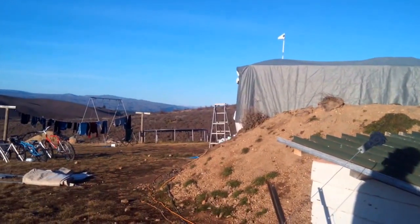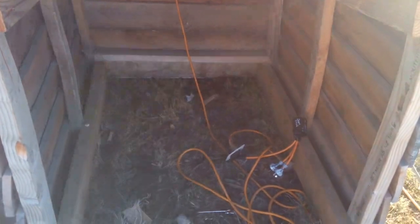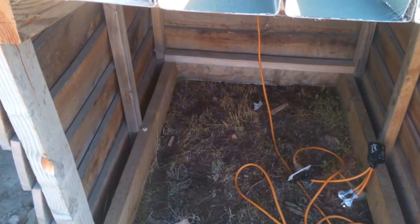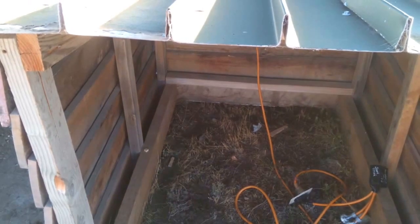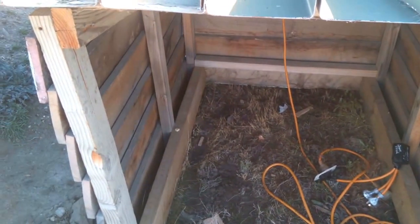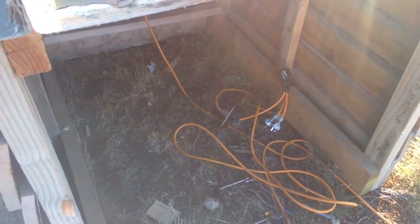Around here we've got a little shed that I built to put the generator in. It's not in there at the moment — I've got it away doing some welding. I built a little double plug to plug into the generator because it only has 16-amp outlets, yet when the inverter clicks on to charge it draws a lot more than that, then clicks off. So as a temporary measure I put two plugs on the end of the cable, but it's not ideal — I've burnt out a plug already and I need to maybe rewire the generator with bigger outlets.